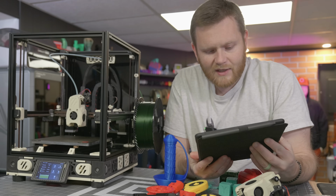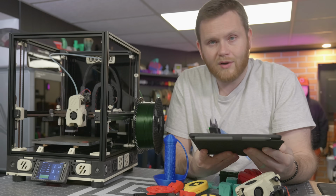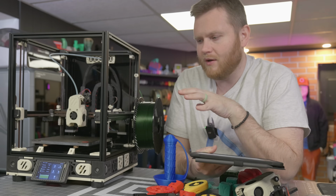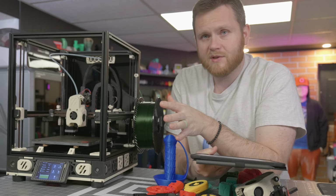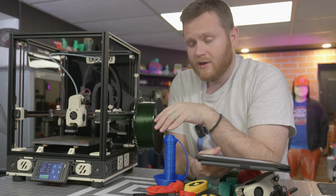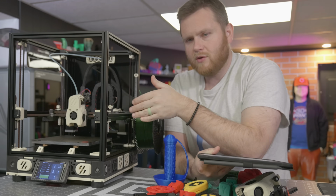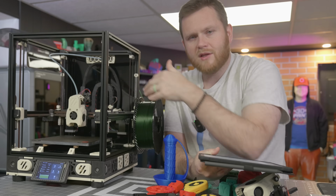All right, number 5 is you have to plan out the build that you want or go legacy. So let me explain what I mean by that. I don't mean legacy like the Voron legacy. I mean the legacy build of the kit, like the older version of the kit. One of the examples is, in my particular case, I decided not to go with any end stops because it takes away so much wiring, and you don't have to have sensors on the X and Y and on the Z. It just uses the stepper motors and the stepper motor drivers to tell when the machine is home.